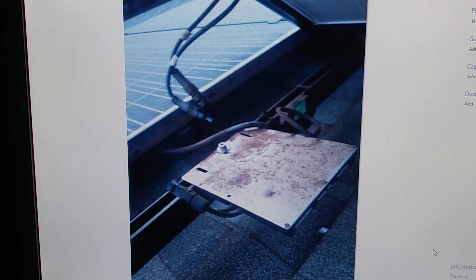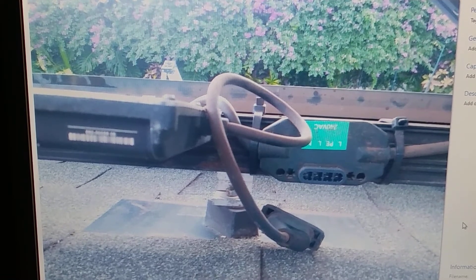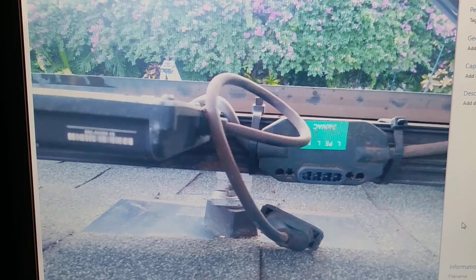You can see the panel wires have been disconnected already with that special tool, just by laying it on the side of the fittings and jiggling them apart. This is the inverter and it's still wired into the main module on the track. After you use that special tool under the connection, push it all the way in, grab the tool and the socket, and jiggle them both out until you get it disconnected. Now all you have to do is unbolt the dead inverter and prepare to bolt on a new one.